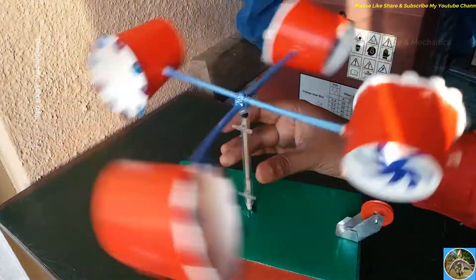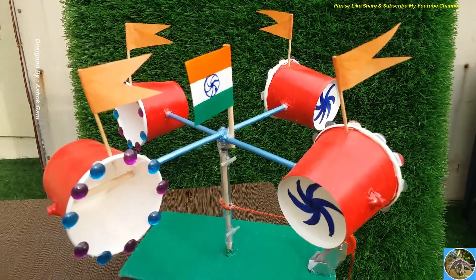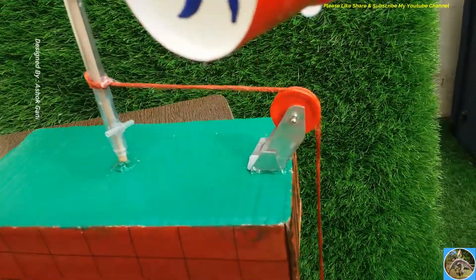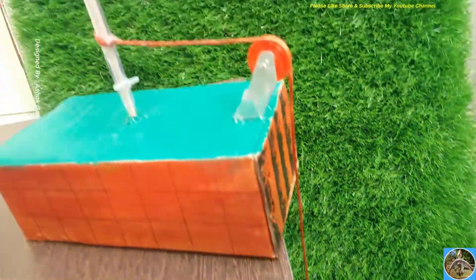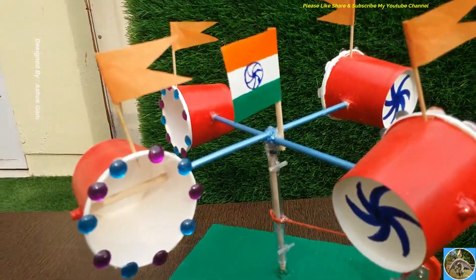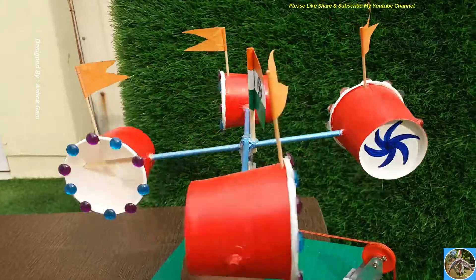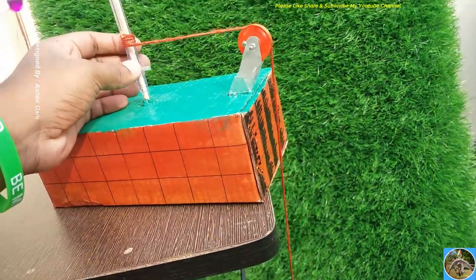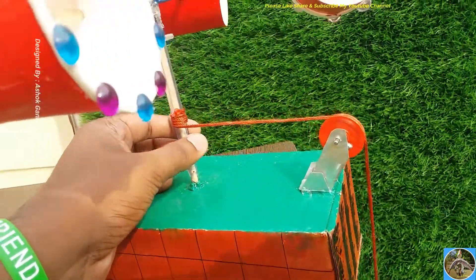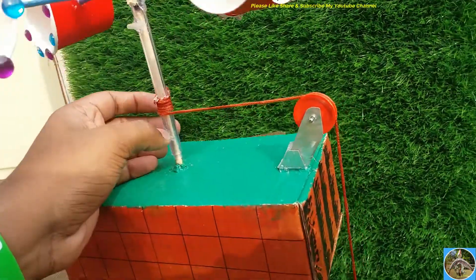To find the velocity of the wind, we use a pulley arrangement with a dead weight provided at the end of the thread. When there is strong wind, it strikes the four cups and the cups start rotating in the direction of the wind. During operation, the dead weight tries to move upward, causing the thread to wind around the vertical shaft.